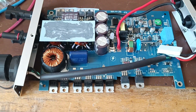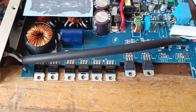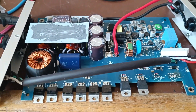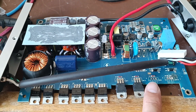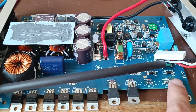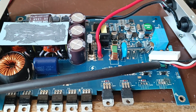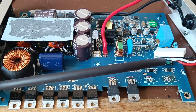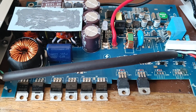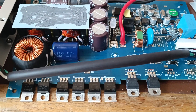Separating it from the grid and all sorts of other legal requirements — most of all, when I unplugged it, it blew two MOSFETs. So I'm going to replace them. It also blew a trace and a voltage-limiting diode, so all of that needs to be replaced. Then first of all I'm going to check if it feeds in power again, and then we move on to some optimization.